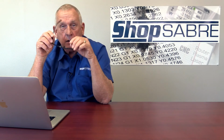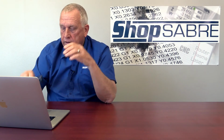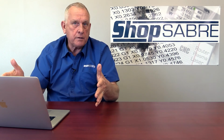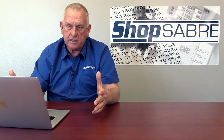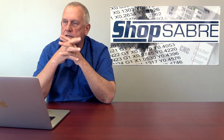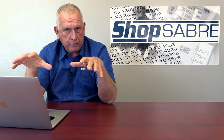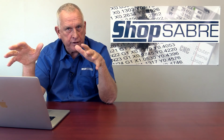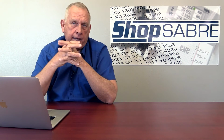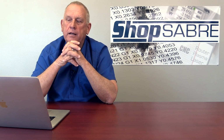Now there's one other thing that I want to talk about before we do that, and that's fixturing, because one of the things I wanted to do, we're actually going to use a Pro Series machine, so it's a big router. It's a typical machine you buy to make panel goods or casework or stuff like that. So what we're actually going to do is combine the vacuum table, the flow-through table, with a little simple fixture. Now lithophanes don't work very well with double stick tape, and here's why.